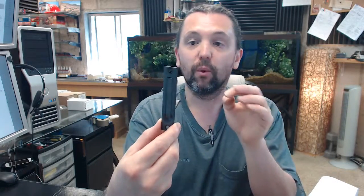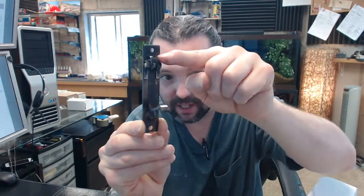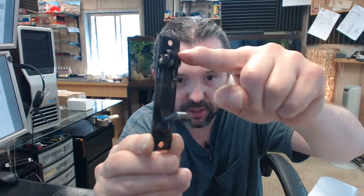What you really have here is two different setups. You've got what we'll call the body, and then you've got the plate, or the face of it. I would create a template where I'm going to route for the body prep. When you're doing this kind of work, it's really helpful to have a caliper, some finer way of measuring than just a 24-foot tape measure. My body is going to come from the area between the screws, so that I know I can accommodate the inner workings of the unit itself, down to here.